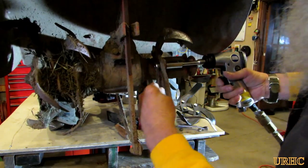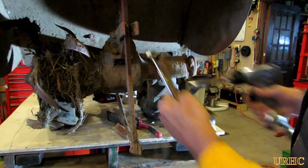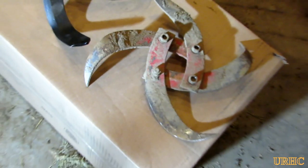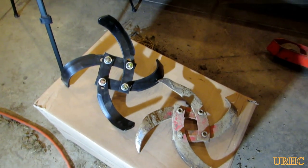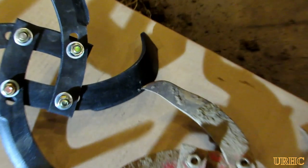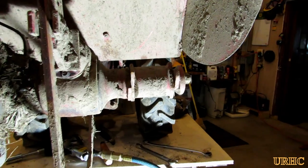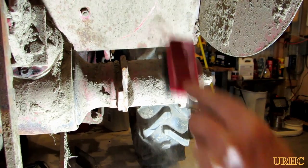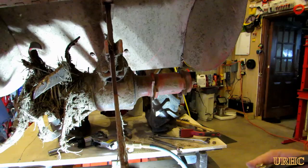This is really the first major thing I've had to do to this tiller in the 10 years that I've owned it, so it's been a really reliable tiller. There's what they look like when you take them off — you can see how they're worn with pointed tips. And there are the replacement tines. I don't like the idea that the replacement tines have extra holes — there's an extra set of holes for different applications — and I think that may be a weak point in the future where they could possibly bend, but we'll find out.